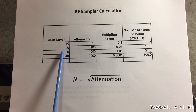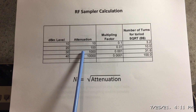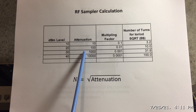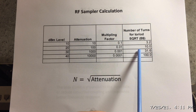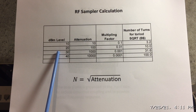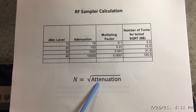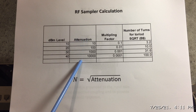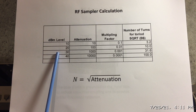This particular sampler I'm demoing today is a 30 dB attenuator, which is 1000 times lower than the input signal. Taking the square root of 1000 gives approximately 32, so you round to the nearest whole number — 32 turns. You'll come very close to 30 dB; maybe it's 29, maybe 31, but it's not critical. You can apply the same formula for 40 dB, 50 dB, etc.